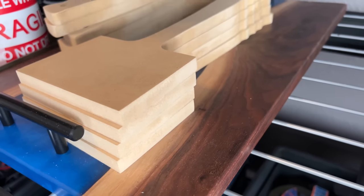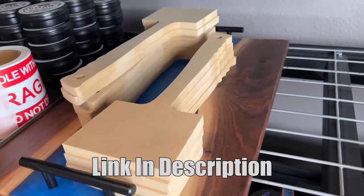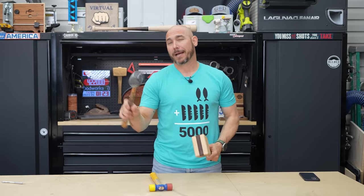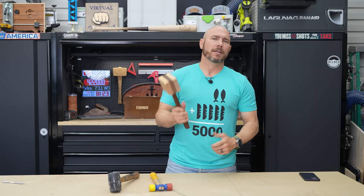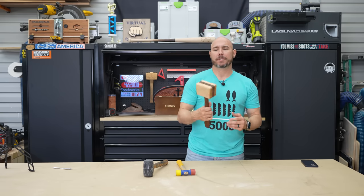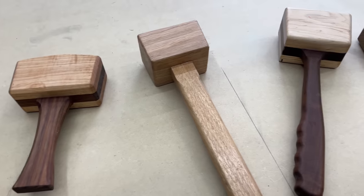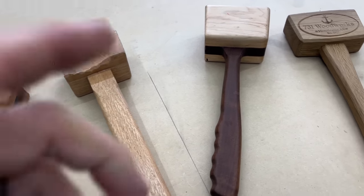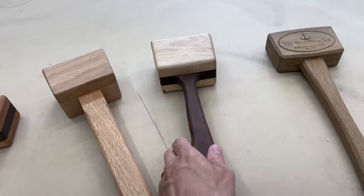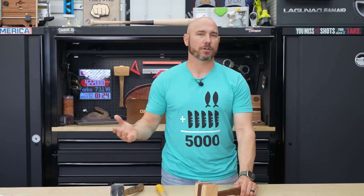Or you can do what a lot of woodworkers do and build your own mallet. We have a template for these mallets to help you build them faster and easier, especially if you've never built one before — link in the description. A wooden mallet is really my pick; it's the one I use the most. Rubber mallets are good to get started with, but a wooden mallet won't mar the wood or cause dents. If you are going to build your own mallet, use hardwoods — don't use pine or anything like that. Walnut, maple, oak, hickory — whatever you want — just make sure it's a hardwood, not pine or spruce.